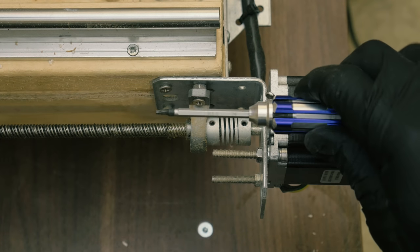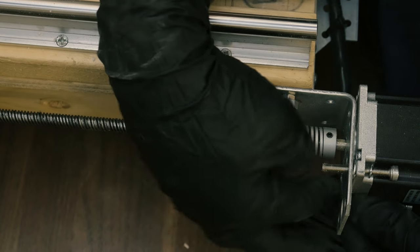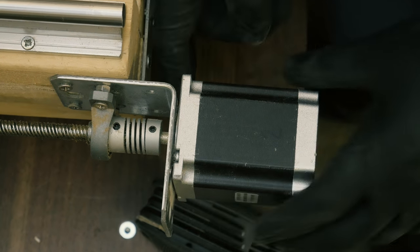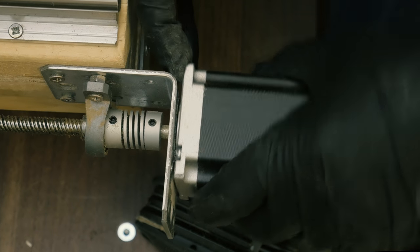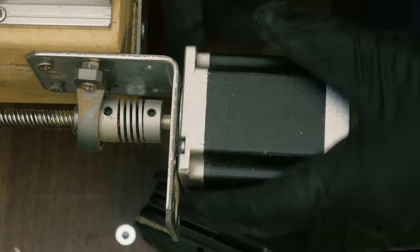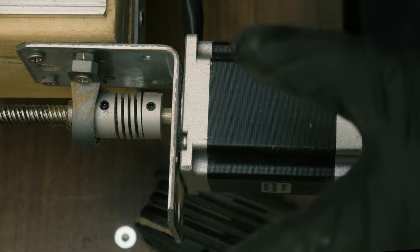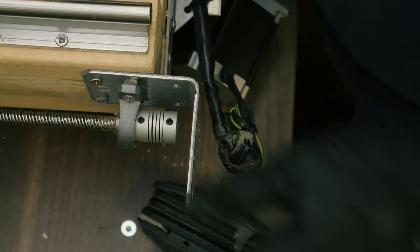This is something I have to do and I'm going to do it now. As you can see here, this angle iron was something I found when I built the machine. You can see that the steel on the angle iron doesn't go further back than here. That means I can't bolt this side of the stepper motor tight to the angle iron. So now thinking about improving it even more and welding on a bracket that goes on the back side here and down, so I can tighten the stepper motor on this side also, just to make the whole thing more sturdy and more precise.